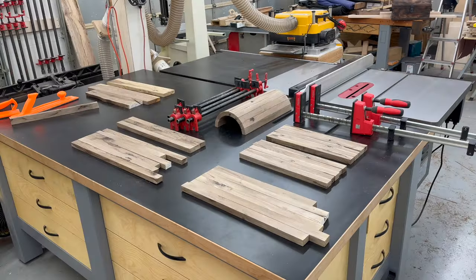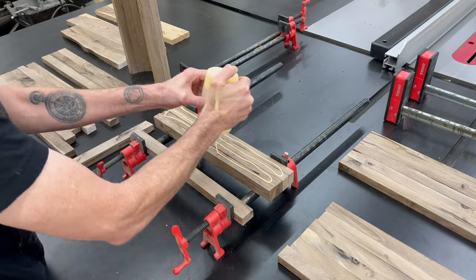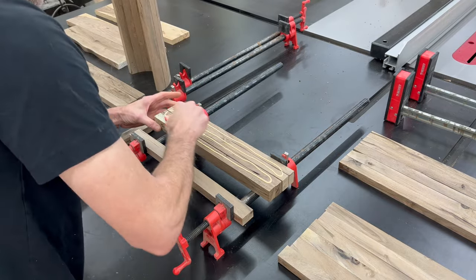Next, we are going to get the strips laid out for some small panel glue-ups. First, we have the front and back panels — these were the other 10 strips that we cut to 16 inches long, and we'll need 5 strips for each panel. We can get both sides of the box out of one panel of 5 strips. The box's bottom panel is made of 6 strips, and both sides of the lid can be made out of 3 strips. Once we figure out the orientation we want all the strips to be in, we can start gluing up the panels.